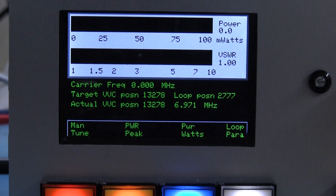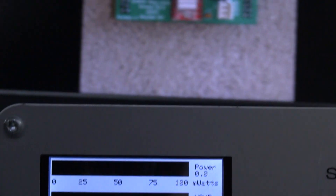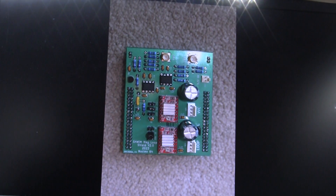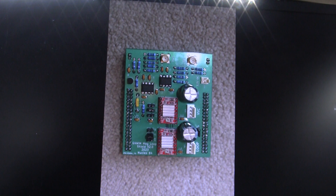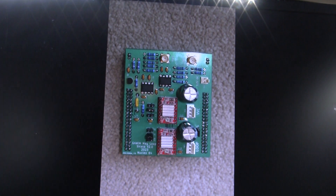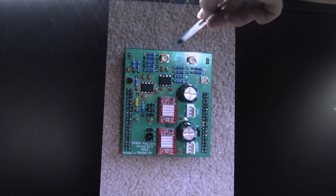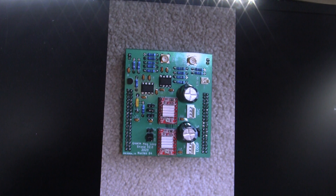So that's very briefly how it works. What does it take in terms of hardware? There's an extra circuit board which has two stepper motor drivers and a couple of logarithmic detector amplifiers — the AD8307s — and two coaxial connectors which take a sample of the RF forward and reflected from an external 30 dB tandem coupler. This little board sits directly on top of the STM32.